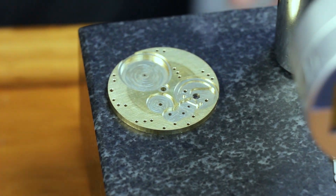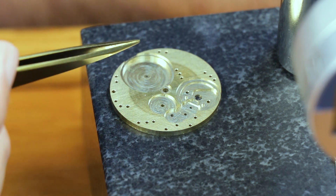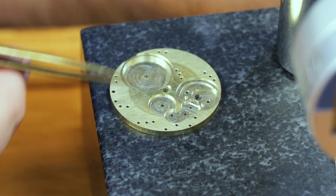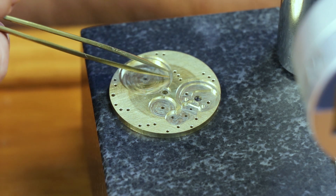It's so good to get back into watchmaking and the prototyping of this watch. This is the main plate — the first time I've attempted to make it. On this tool I compared the depths to the depths of the 6498 movement, and it varied between being bang on and about plus 0.03 of a millimeter out, which could be down to some air bubbles in the tape — it wasn't sitting perfectly flush. I'm thinking I'll make these recesses maybe a tenth of a mil undersized, then do a finishing pass and clean it all up in the watchmaker's lathe, so I get a really nice finish on the recessed bottom and along the walls.